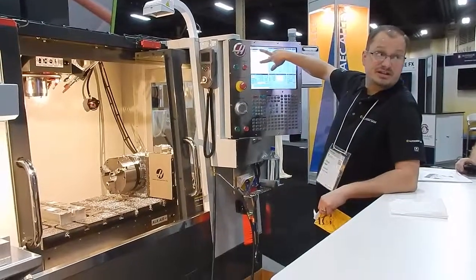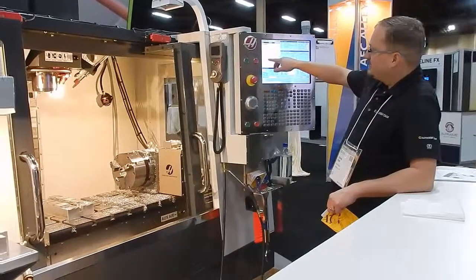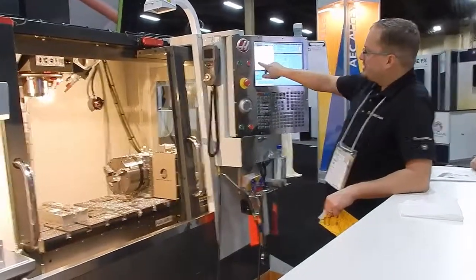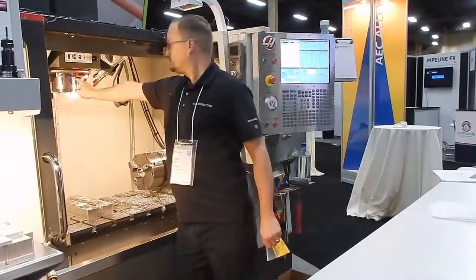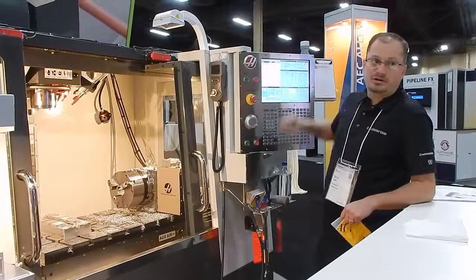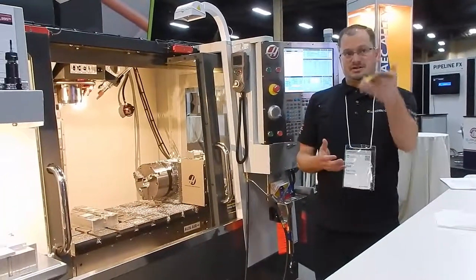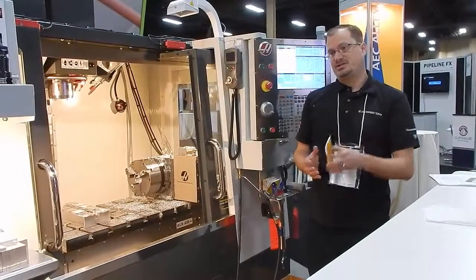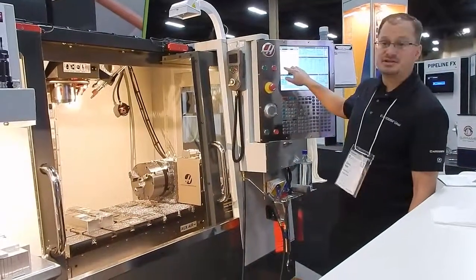This is all the tools, just like when you saw the output today. As I start going through here, the S value is giving you what the spindle speed is going to run. And as I keep going down here, G54 — the G54 is zero. The very first thing he had you guys do in the setup was zero, and that is a G54 command.